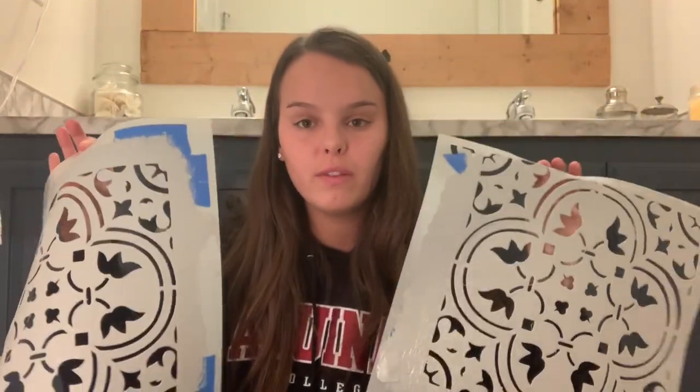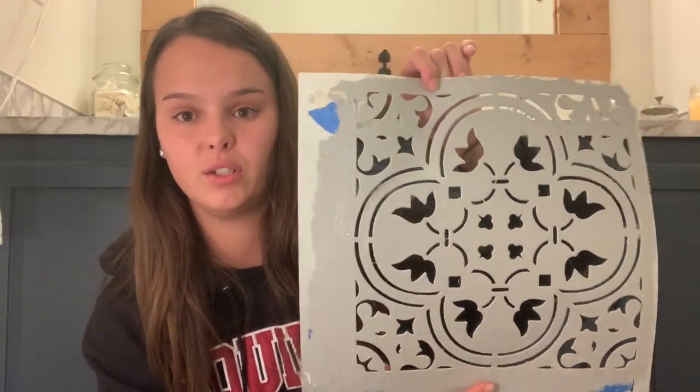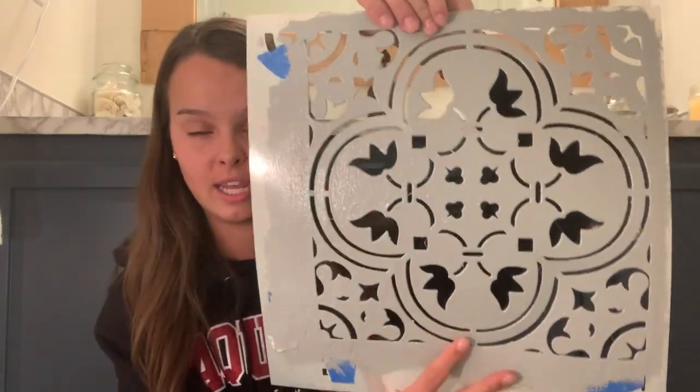The next product is the stencils I used for the floor. Don't skimp on a cheap stencil — buy a nice quality stencil. I used Stencil Revolution. I found them on Amazon and they had great reviews. This is what my stencils look like. I got two of them so I could work double time — lay one down, paint, lay one down, paint. You don't have to buy two though. You can order them depending on the size of your tile. My tile is 12 by 12 and I got that stencil size — it works awesome. I'll put the link down below. Not sponsored — I wish.